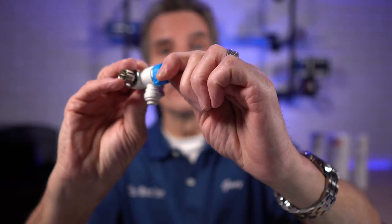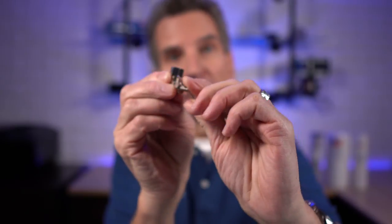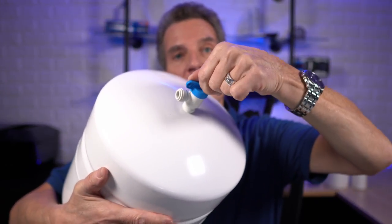The next step is to turn on the water and check for leaks. Open the supply valve — I open it about halfway first and let the system fill, then check for leaks before going any further. If there aren't any, open it up all the way. Run it to the left to allow water flow and let the whole system fill. Once it fills, have a look for leaks. If there are no leaks, go to the tank and turn it on — turn the handle in the direction of the tubing to open it.